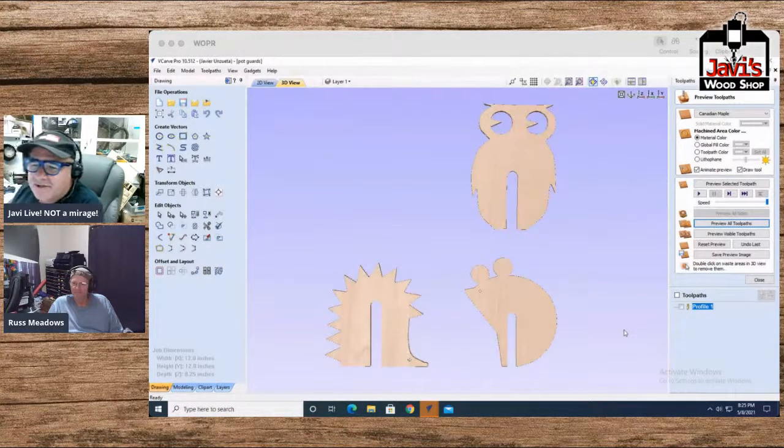Okay, so I just installed a homing switch now. When I touch the tools off and save them in the library, then come back the next day, I start the mill up and home it. The tools that I touched off from the other day are off by a few inches. Why is this? Maybe someone can have an idea. Okay.